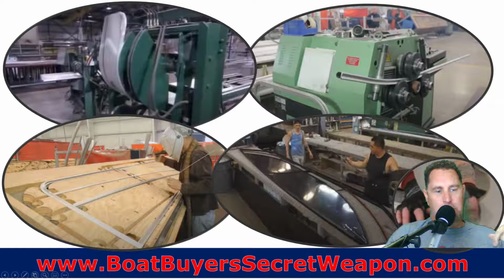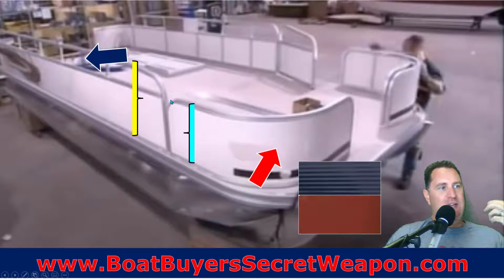That paneling, the better manufacturers will use some sort of a sound dampening layer between the fence rails and the paneling, which makes it fit tighter. It doesn't rattle as much. And then we're going to bend the fence rails to get the contours we need for the boat. If it's an individual rail, they'll bend that, or they'll bend the whole panel together, as you can see up in that top left, so that now we can mount those fence rails onto the boat.